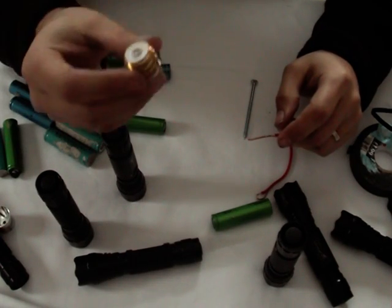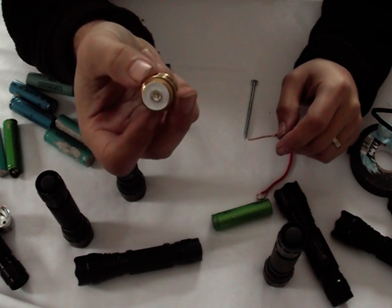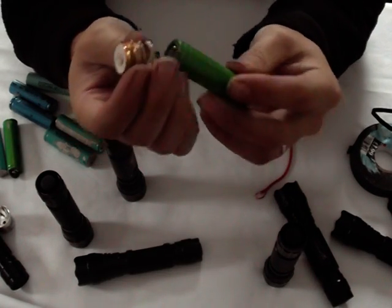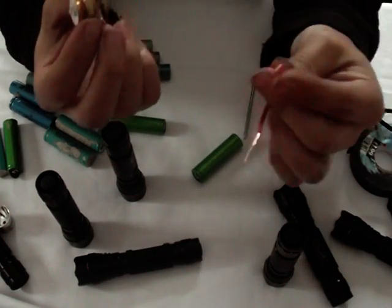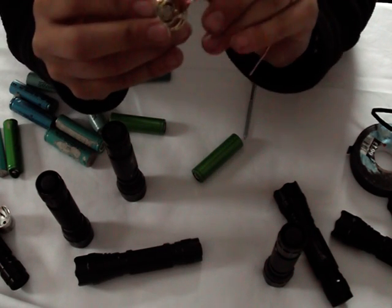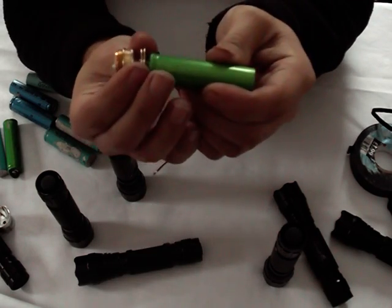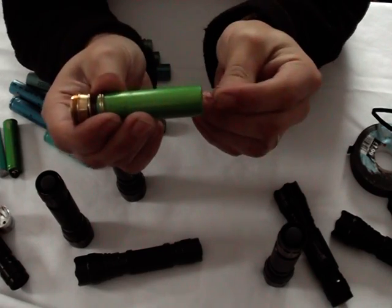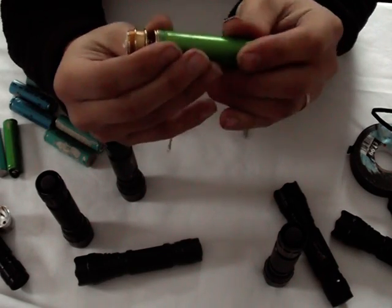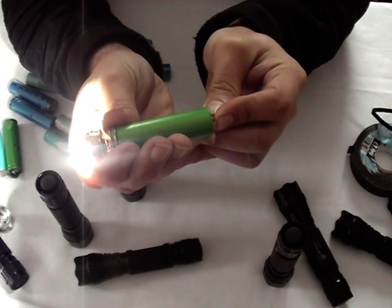Lastly, if all else fails and you're pretty convinced that it's your drop-in — this is the drop-in here, the P60 size drop-in, this is an old XRE chip — if you're pretty convinced it's your LED or your driver that's failed, then I find a simple test: just take your 18650 cell, get a piece of wire, fold a loop on the end, and just push that into there to make a contact. You can make the world's simplest torch — push the battery up to the tail spring, push it over the top, and then you can just test the light there and see whether it's bright enough and working. If you find intermittent faults but when you hold it like that it works fine, you can pretty much be certain that the fault lies with a loose connection or a problem with the switch.